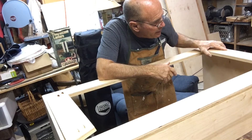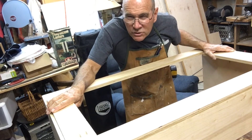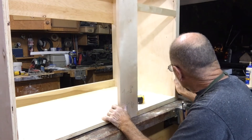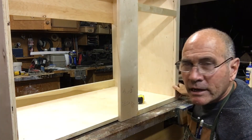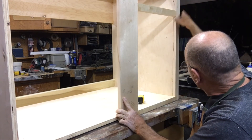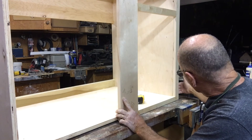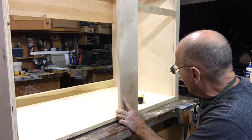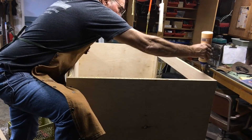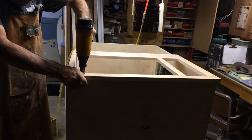That piece is going to go right there, and I'll do the same thing on this side — glue it and screw it in place. It's time to nail my face frame onto my cabinet. In this situation, I'm going to nail it flush. The face frame is going to be flush with that panel right there, which makes it easier to attach the drawer hardware without spacers. It's also going to accommodate the new cabinet I'm making on the other side. So I'm going to turn this on its back, glue up the plywood on the front, and nail it down with my 15-gauge nailer and 2-inch nails.